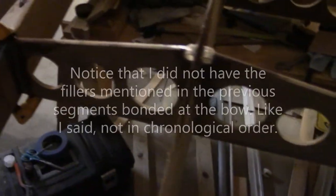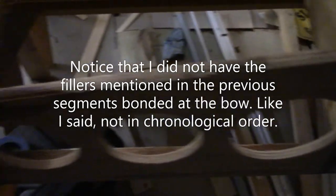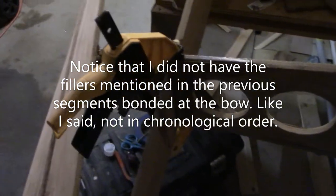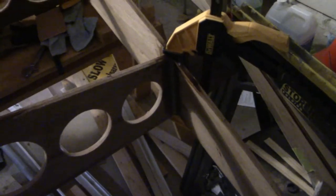Just like that it's in — got the drain tubes bonded in place, just waiting on the epoxy to set up. I mentioned earlier that I made this rib a little bit wider to kick out a little reverse curve I noticed in it the other day. Got this line now nice and straight with just a gentle outboard curve, which is exactly what I wanted. I'll check on this in the morning.